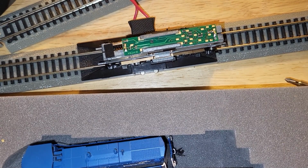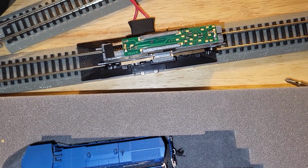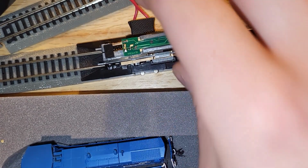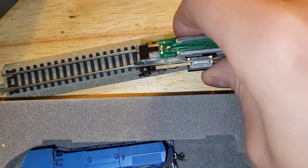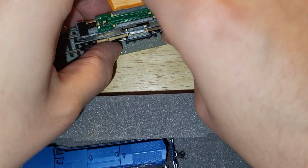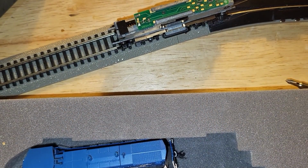Let's write that. Okay, talk to it. I didn't get an error. That's definitely a good sign. Let's go to 3 again. Get rid of my programming track. Reason why I do it on 2 different tracks is the programming track has better luck 9 out of 10 times trying to get these locomotives running again after they've been made inoperative for whatever reason.